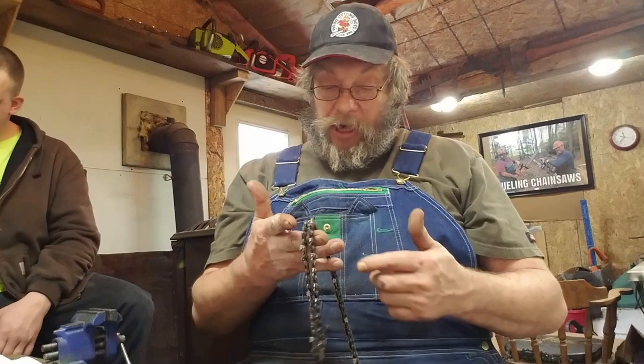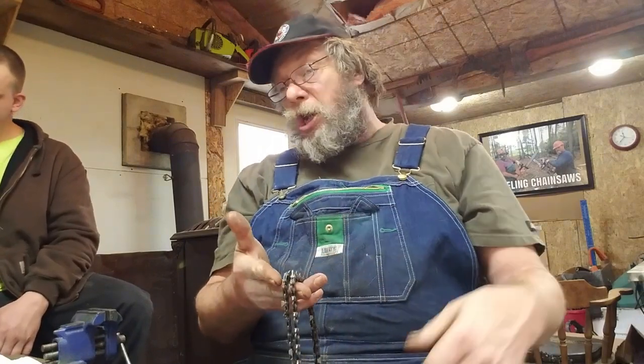There's very few people that I've ever worked with logging that understood this relationship. I've just told you my secrets. But there's few people that I've worked with that have a spot-on saw all the time. Well, mine isn't either, but I know by reading my chips. Do I need less raker? I'll take a second, go zip, zip, zip, maybe half a swipe. If I catch them where one tooth's back further than the other, you give it a little more.